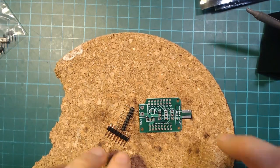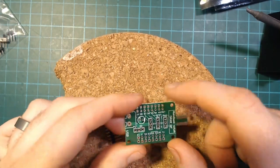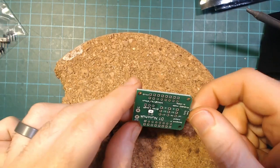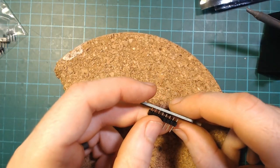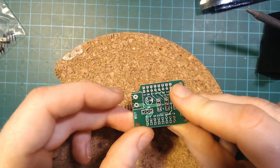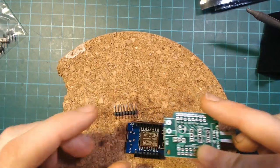Let's open up the basic kit — no add-ons. Inside you get the PCB and two male headers. This side of the board is the top and the other side is the bottom. We're going to take the male header pins, place them into the bottom of the board, and solder them from the top.